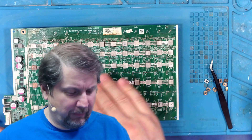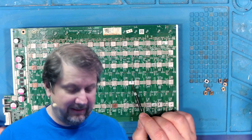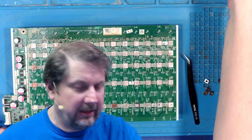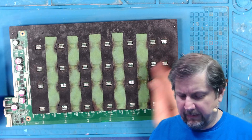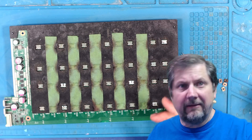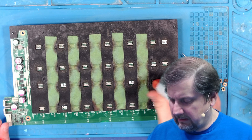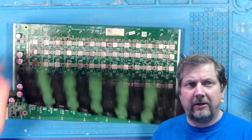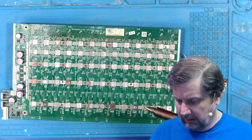The nuts have all been removed and some of them — like this one right here — had plenty of solder on them, but others were really weak, so it's a good thing I took them off. To make it easy, I've got this guide made out of what feels like some kind of fibrous material so it can take a lot of heat. With that I know where to put the nuts. I'm just going to go through and mark it, then take that off and get it out of the way. Then I'll use my desolder station and clean them up.